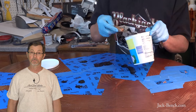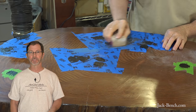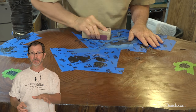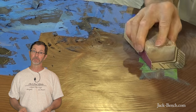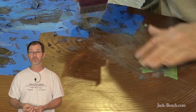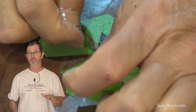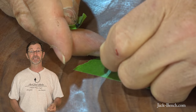The Crystallac is really not intended for what I used it for here — it's more intended for just filling grain. For filling these larger recesses, there was a problem because it would shrink back, and I had to apply several different layers to bring it level with the surface of the wood. The advantage to the Crystallac though is it was very easy to sand off, so that part went very well.